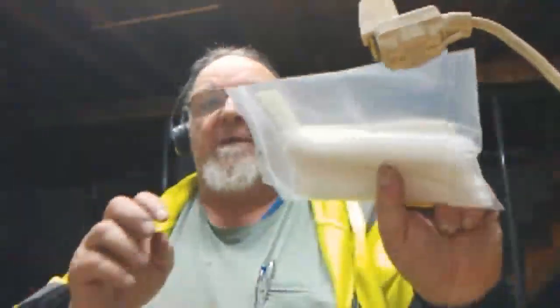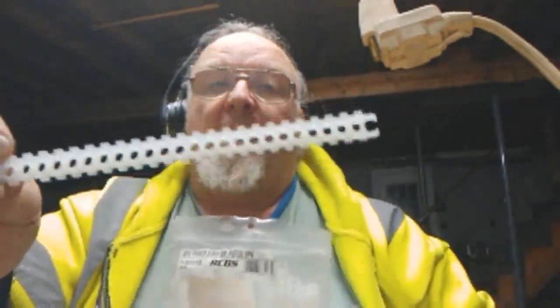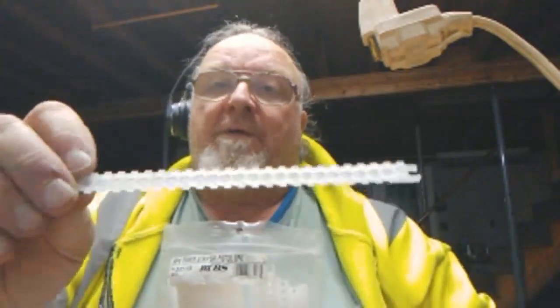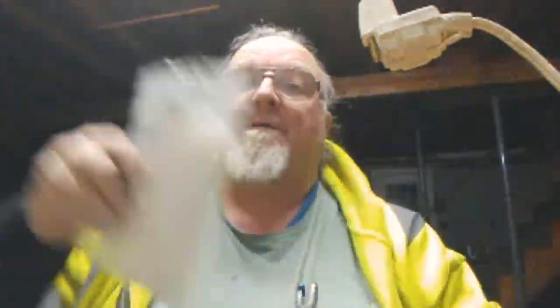And get that thing back in there. That'll seat 25 primers a piece into these things. And you can buy the CCI primers that are already in these strips. They're reusable. As you can see, I got quite a few of them in that bag. So whatever you're doing for caliber, you get one size that's for large pistol. This happens to be for small pistol, small rifle, either one. The primers are the same size on all the small pistol primers, and they're all the same size on the large pistol. So it's just a matter of sliding them into that charger and priming them up 25 at a time, and you put them right into the side of that APS system, one strip at a time, and just keep pulling the hammer, and it primes up all the cases that you've got.